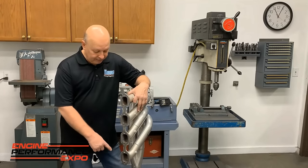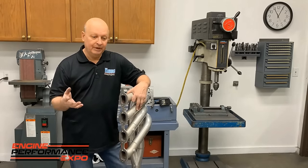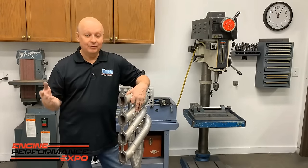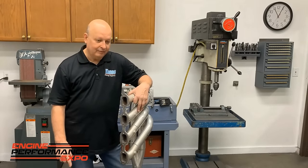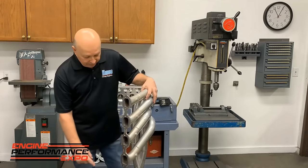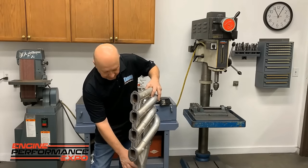And you think, well, how does it get through here? How does it go back? Well, when you put a big camshaft in the motor, both valves are open at the same time. Manifold's got vacuum, it pulls it through. And we actually did a test when we had the infamous finger in the port thing where we were doing some of those things. But we drilled a hole in a header down about here and down on the bottom.